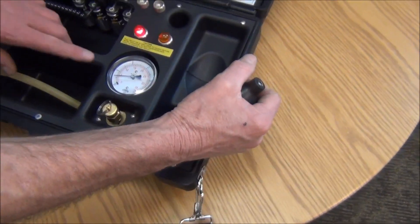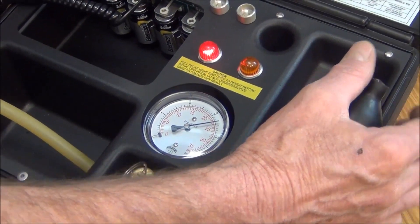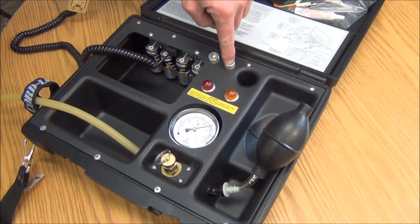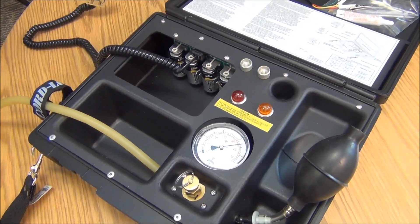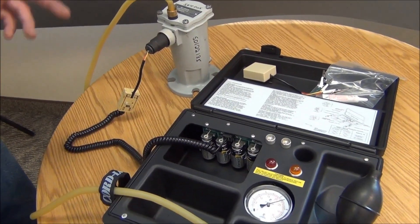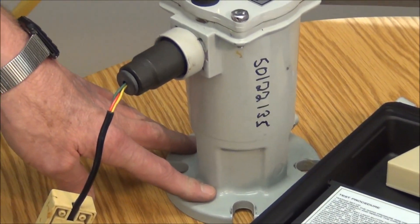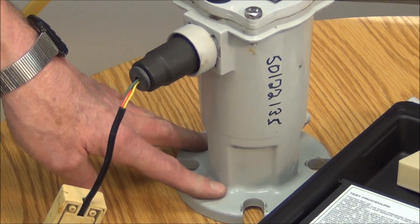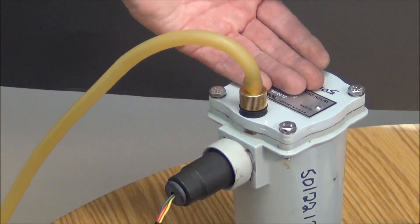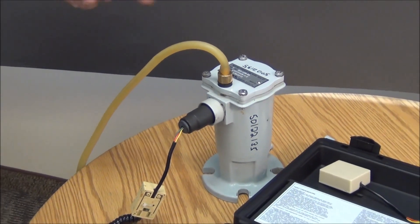The next step is to take this squeeze bulb. There's a little chart on the instruction sheet to tell you what pressure to run it up to. For a 900 unit it's between three and a quarter and three and a half PSI, which I've reached. Once you reach that, push the right button and a timer comes on for about 60 seconds. You have to wait 60 seconds to let the unit stabilize. What this test kit does is simulate changes in pressure in the tank. In the bottom of the unit there's a sensing bellows that reacts to increases in pressure. When the pressure goes up, oil inside the unit travels to the top where there's an actuator with a switch. For low rates of rise the switch won't trip, but for a faster rate of rise the switch will trip.